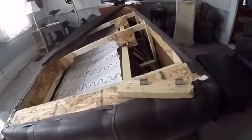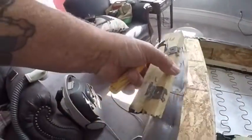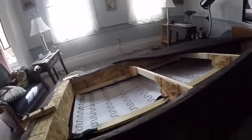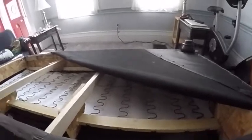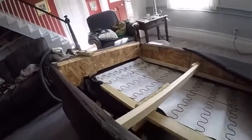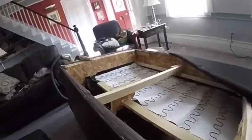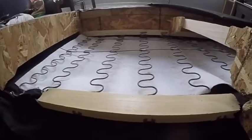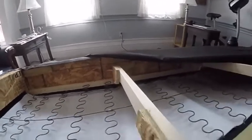So these boards have these little spring hangers on the back of them. They're just hammered into place there. And this cloth here is stapled down onto this stuff that's sitting here. I think my best bet is going to be to take this entire board out, cut me another piece out of some kind of good sturdy hardwood, put it back in there, and try to relocate all these spring hangers. See, those there can be slipped back into place on that side.